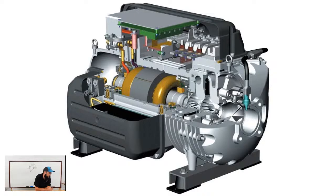Do you use the Danfoss software, or do you have it all on the HMI? So yeah, we use SMT, service monitoring tool, the laptop tool for Danfoss for the turbo core specifically. Daikin doesn't give you all of the data that you can get from SMT, but it gives you a lot of it. And that's only with the new interface. Keep that in mind. That's with the new HMI. The original series that looked like something from the 90s didn't give you any of that, or at least not near as in-depth. But the newer interface does, and Daikin made one hell of an interface when they did that.